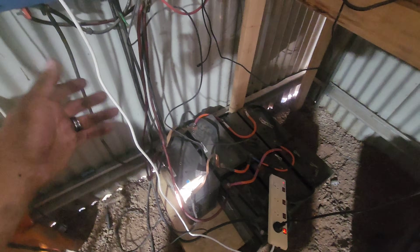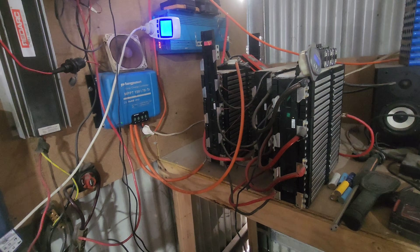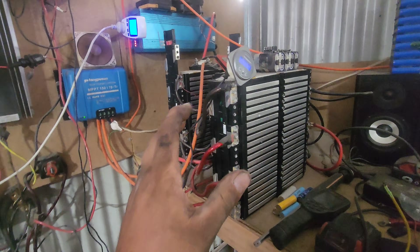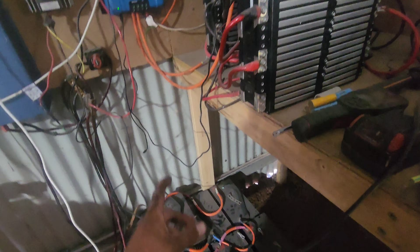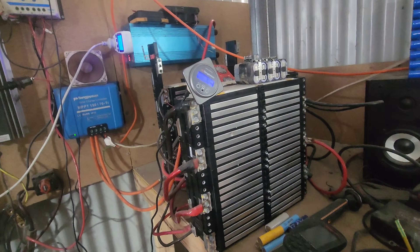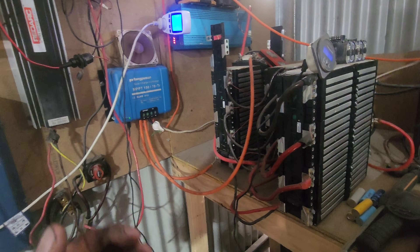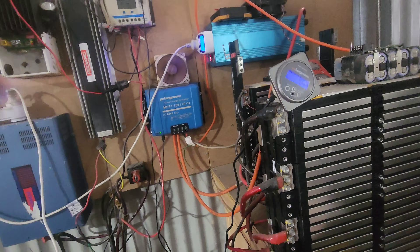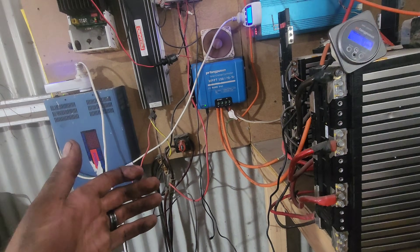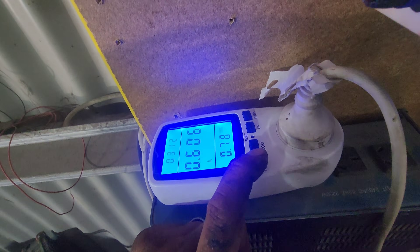This side over here we're just running some crap we've got to get rid of — wear it out, whatever, just catching free energy from the sun. This is always full and I'm seriously considering putting a timer on this to charge it around 2 o'clock so it won't sit on float all day. It'll do about 15 kilowatts a day in summer no stress — there's 3,000 watts of solar on the roof, and when we get full 70 amps through that we're at about 2,100 watts because it's over-panelled.